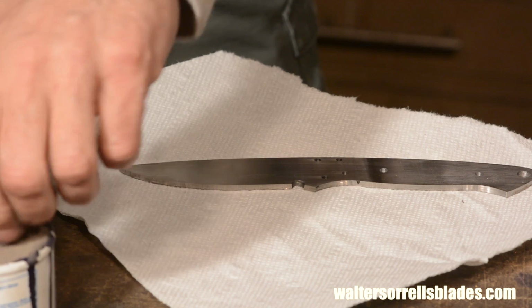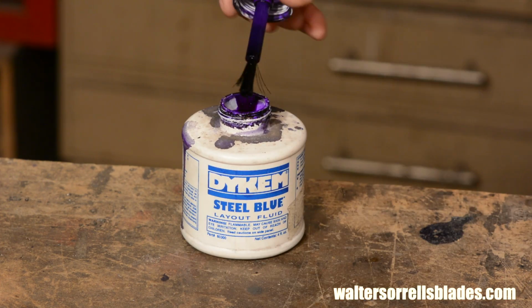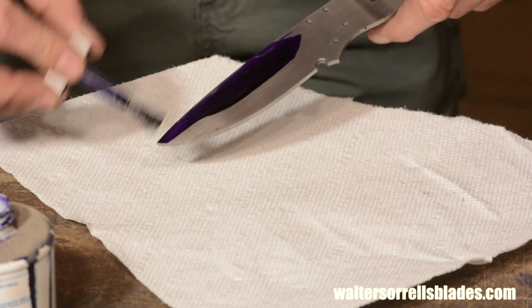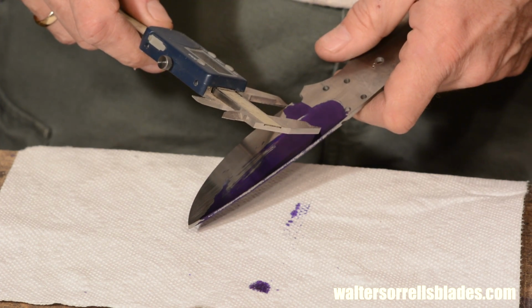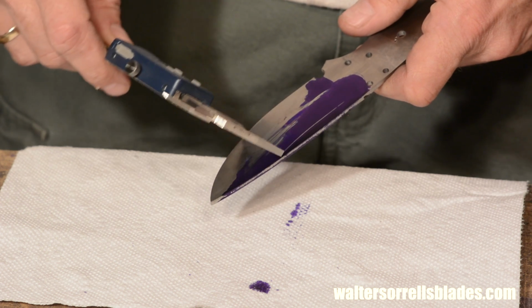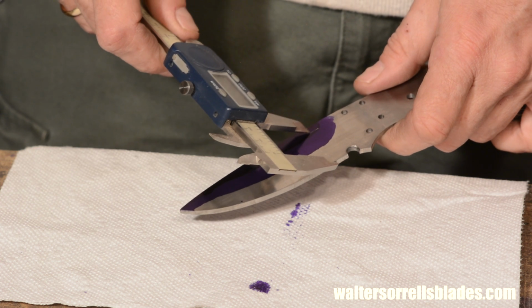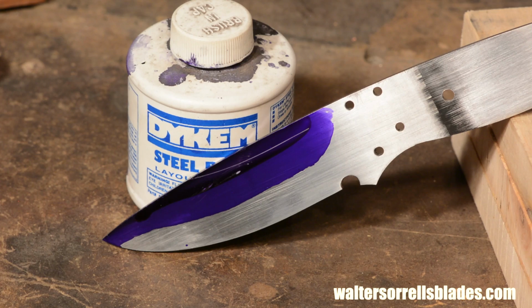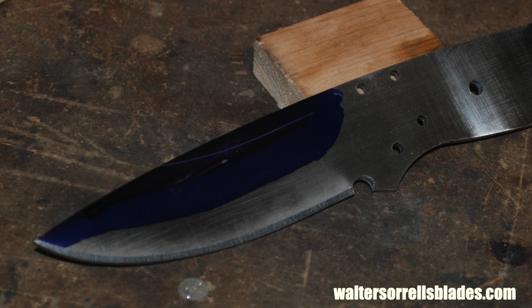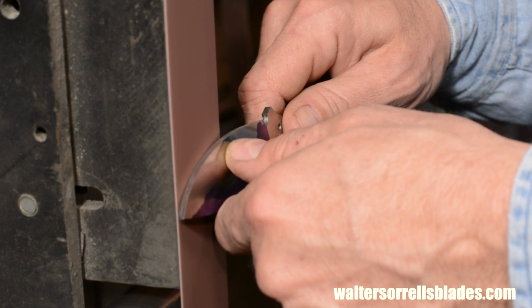Additionally, I'll paint the blade with machinist's layout fluid and then use my calipers to scribe a target grind line. I don't need to hit this exactly, but it gives me a rough target. Anyway, here goes. First I'll establish the beginning of the bevel. Then I'll tighten up my angle a little bit and start grinding the bevel closer to its ultimate grinding angle.